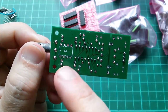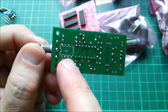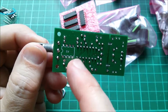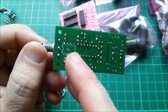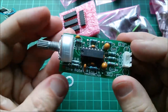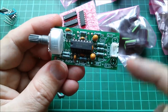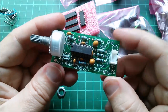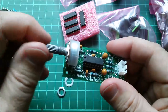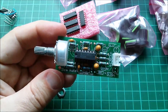There's an 8-pin array here on the bottom, but that's to take one of my little daughter boards which has a stereo full-size quarter-inch jack on this one, and that's for the foot switch. But in order to test this I didn't need to fit some of these components, so they're not fitted yet. I will fit those in due course when this board needs to be integrated into the vocoder system.